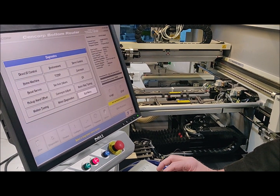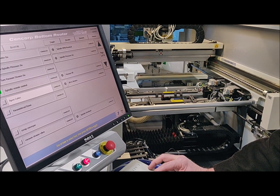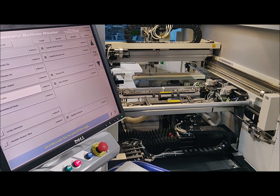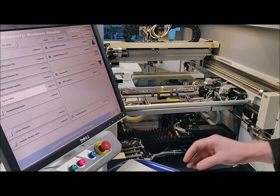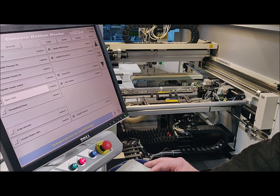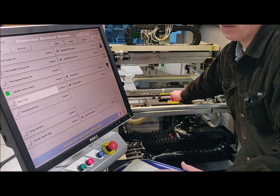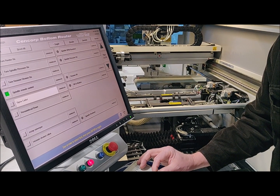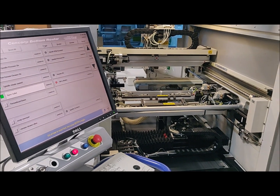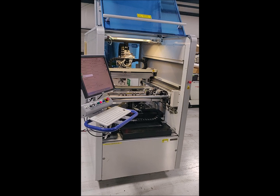We're going to look at the bit detect feature on this machine. You can see it's detecting the bit — the red light is off. The bit detect feature is a little flaky because it's attached to the vacuum hood around the collet, so it was turned off when it arrived here. The system is functional but hasn't been consistent. If I open the collet and take the bit out, once I pull the bit out you'll see the light comes on indicating the bit is gone. That's the demonstration — please let us know if you have any questions. Thank you.